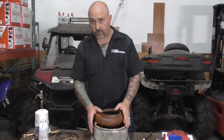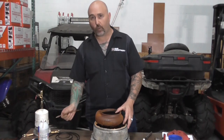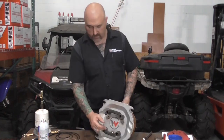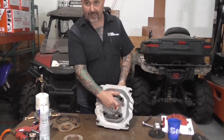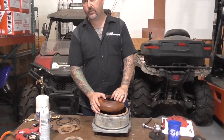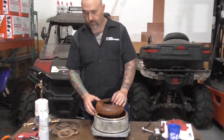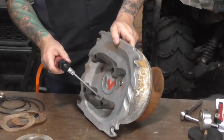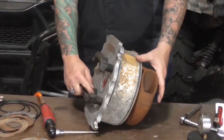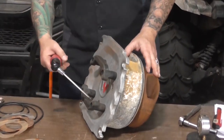The pump overhaul kit includes all the O-rings, a set of four shims, a new insert with new nylon-insert lock nuts on the back, three screws, and the seal rings behind those screws that hold the volute on. We'll remove the volute, replace those bolts and seal rings, install the new insert with shims, and explain the shimming process. Note: to get the last screw out, you'll need to remove one of the handle screws and slide the handle out of the way.